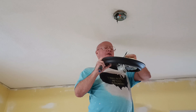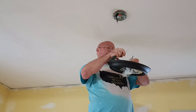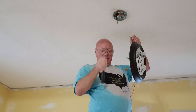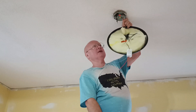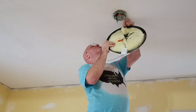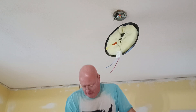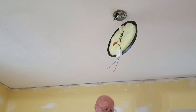So we hooked our little box up here. We're going to take our ground wire here and get it up around the grounding screw, get all our strands together, and leave a little slack in case we need to hook it up later. Does it fit flush to the ceiling? Yeah, we'll flush it up. Do you need any wire for a pigtail? No.